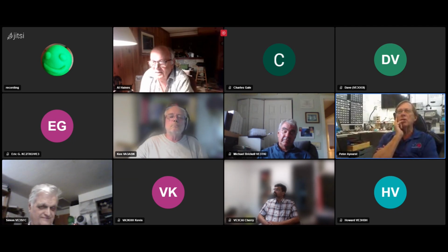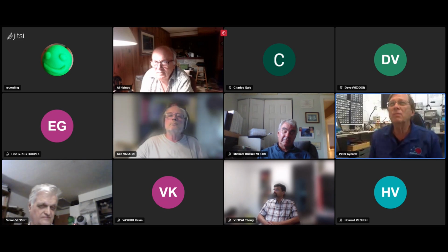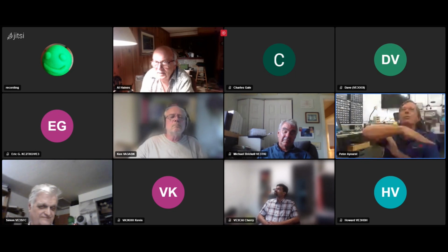I'll be interested to see your results for sure, because I think I got pretty much linear down to about minus 70-ish, 71 dBm. And on the positive side, I think I got up to about plus 10 dBm, something like that. It's been so long, I can't remember. With a little bit of magic, it probably could have been programmed in a second linear range, because it kind of came down like this, and then it leveled a little bit more. So you could get a little bit lower, but I didn't bother with that stuff. But I think you'll enjoy working with that chip.